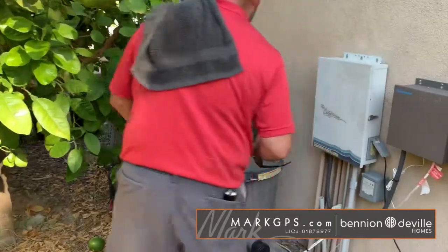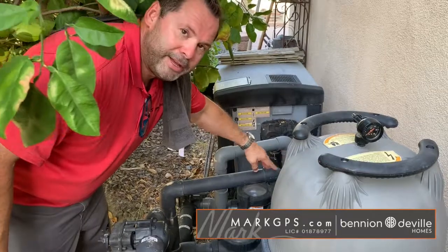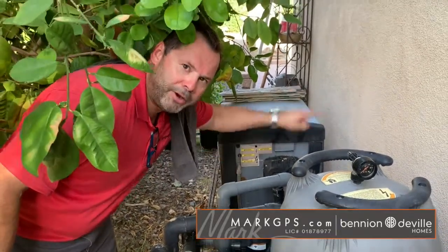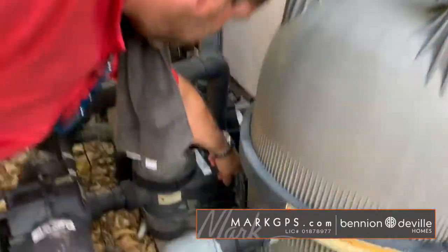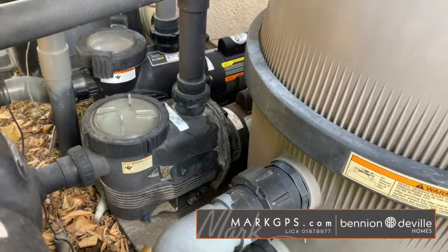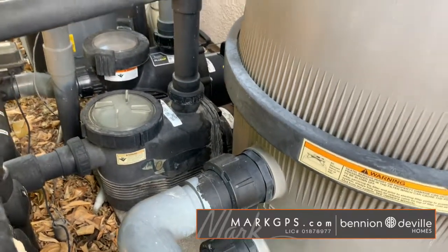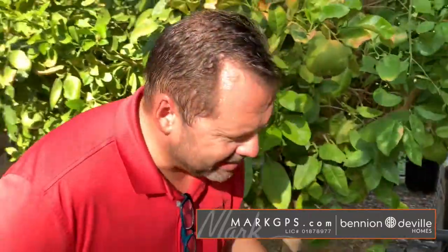At the pool equipment, this pump — the one that provides the water accents — leaks when it's running. It's not coming from the plumbing connections, it's coming from the housing itself; that's what that water buildup is. A pool guy can fix that — they put a gasket in there, take the motor away from the pump, seal it back up, and tighten it all.